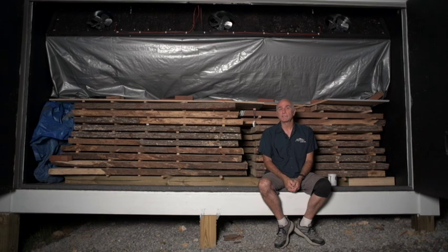The second thing I would change is the width of the kiln. The Virginia Tech plans call for it to be 13.3 feet wide. I don't know why. That's just an inefficient use of sheet goods. If you're not using sheet goods, then it doesn't matter. But for me, right now I cut my logs at 10 foot before I mill them. So it works pretty good. But if I cut them down at 9 foot, it really wouldn't matter. And my back would probably thank me for it later.